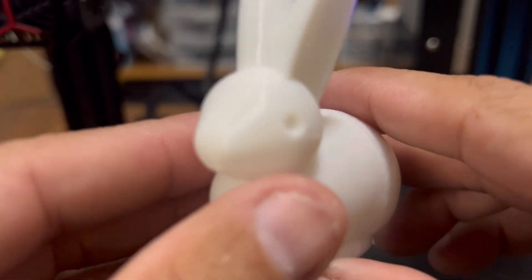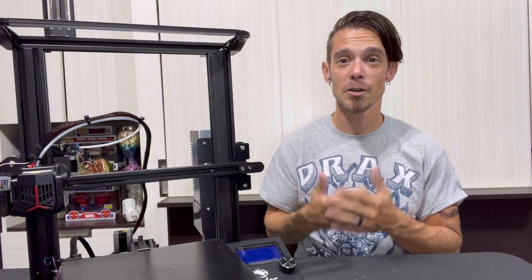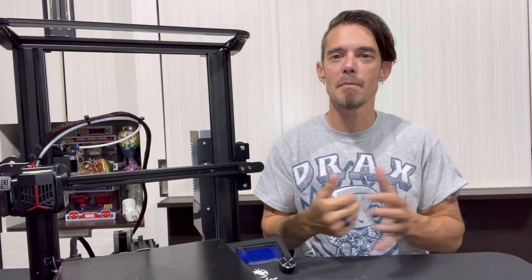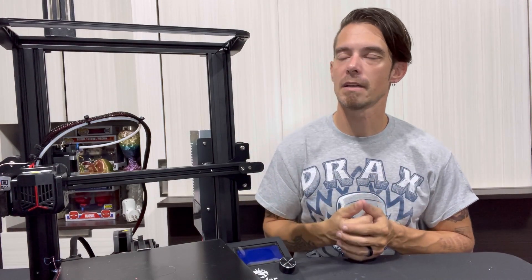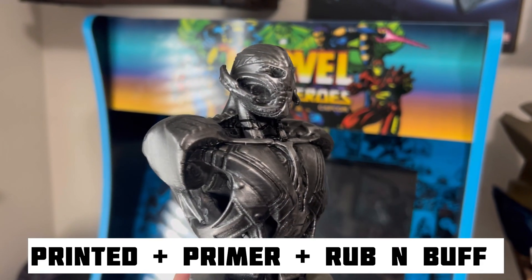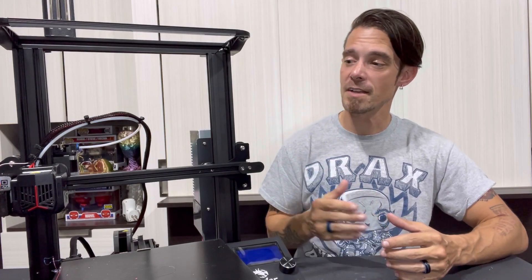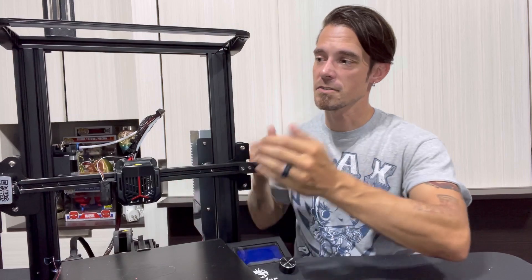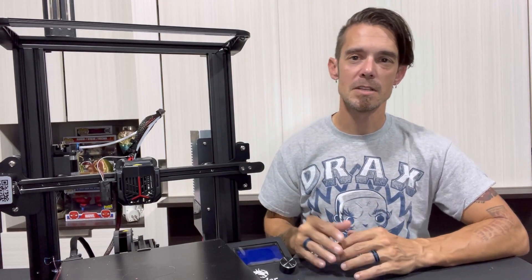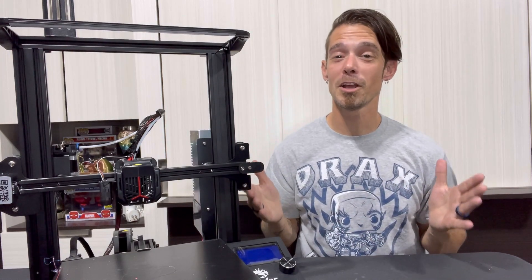Now that we know the install is working properly and everything's wrapped up, let me give you my final thoughts. There you have it — the how-to of adding a second Z-axis and converting your printer to a dual Z. It's a really great upgrade and not too hard to do. Even if you're new to 3D printing, everything is essentially plug and play. This is really going to pay dividends, especially over time. It's going to cut down on wear and tear on your rollers and belts, help keep the gantry level, and result in much better prints over time. For those wanting to print a little bit faster, having two rods versus one is obviously going to stabilize the hot end and the X gantry substantially more. Belts and eccentric nuts loosen over time, and mid-print that could be detrimental to print quality. Doing this upgrade helps you in multiple areas — keeping print quality up and wear on your printer down.